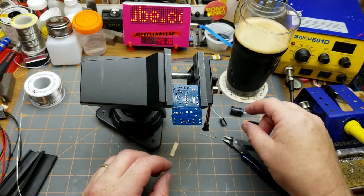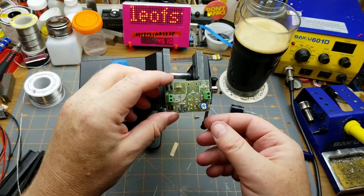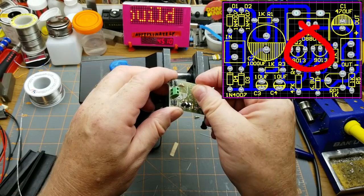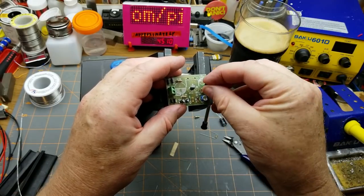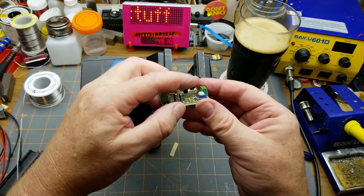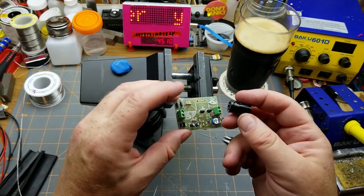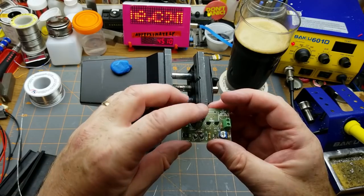What's left? The big capacitors. Let me de-blob those. I think the little transistors should go in next — they're both the same 9013, just common little NPN transistors. I'll bend the leads a little bit. The silk screen on the board has the flat spot marked, so I'm going to trust the kit people on that. I might as well put the big power supply capacitor in too — negative goes that way — since it won't get in the way of soldering the transistor.